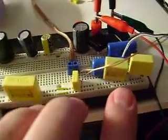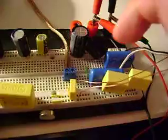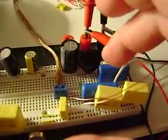What I'm trying to do here is be able to isolate what I'm producing off of my back EMF and storing it on this side of the board. Run it into that primary and then the secondary comes out. It goes through two capacitors into this full wave bridge rectifier. It works better if I have it going through there than directly connected. Then I have storage capacitors across that rail there and I'm measuring it directly there. Then I have these leads coming back to the battery.